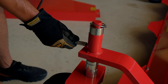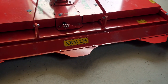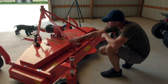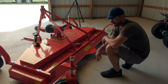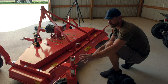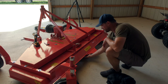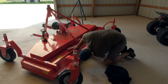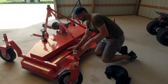This is a made-in-Italy unit. You can see these protectors back here — I don't really know what they're protecting. This is a rear discharge unit, so everything's going to fly out the back. This top A-frame has another set of holes down below, so you do have some adjustment there. We talked about the shims — these are how you adjust your cutting height, because it's going to ride on the ground. You adjust at all four spots to change your cut height. The blades are pretty much sitting flush with the bottom of the pan, so that's about your cut height right now.